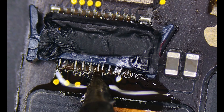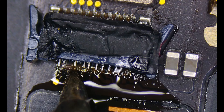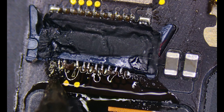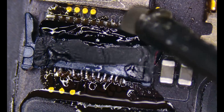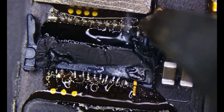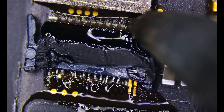That way I'm not applying too much heat to this NFC. I'd like to keep the amount of time that I have a heat source on this NFC minimal, and as I do this with each one of the pins, eventually this entire connector will simply pop off the board. On the last ones in the front row I'll add some flux to the top and go in with the soldering iron, pushing these pins down and letting them slide out one at a time, patiently.